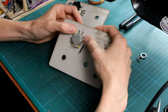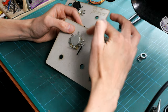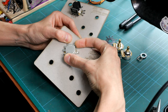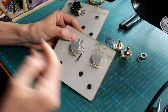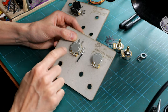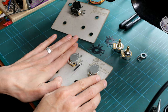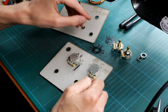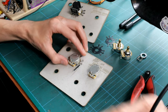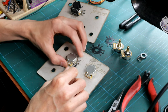This little washer sits between the pot casing and your pickguard or body and provides multiple points where you can make your ground lug connections. These are simple bendable lugs — you can bend them into position wherever you want them. You can snip them off if you don't need all of them; there are three either side and two at the rear. If there's a cavity wall running right up to the pot casing edge and you haven't got the space, you can trim them off easily with regular snips, or bend them up with pliers or fingers into position.